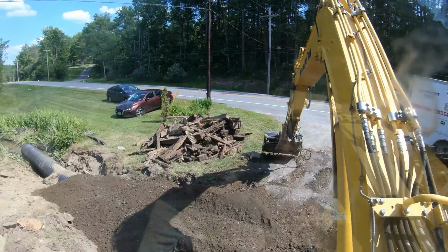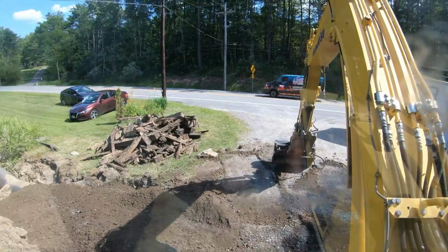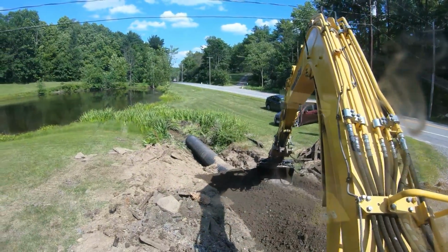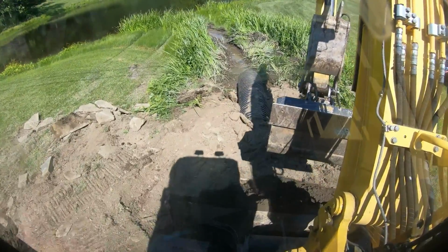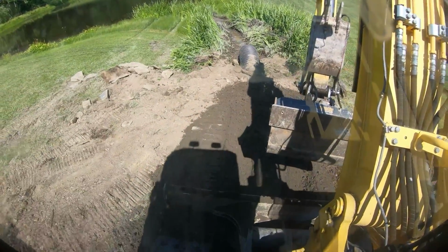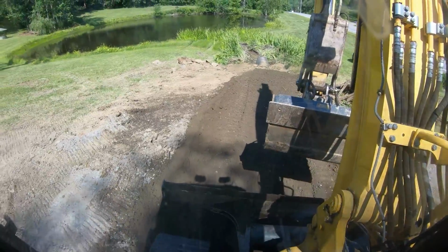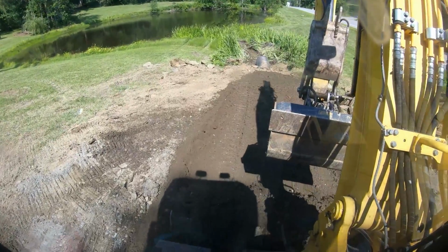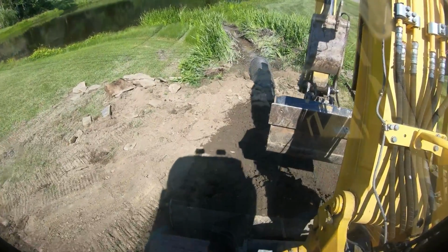Alright, just clean it up as I go, because the crusher run's going to be next, and that could be piled right in the same spot, which would be perfecto. Right on down and out. Crusher run's here, just taking the rest of this gravel, going over the culvert, making a notch, tracking it in as it goes too. Just straddling the culvert. It's working fine. I'll probably leave it a foot low where the driveway is, so we have a foot of crusher in that area. Like I said, we'll have enough, and then I could use the dirt down here anyways.